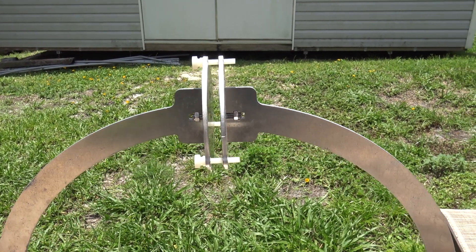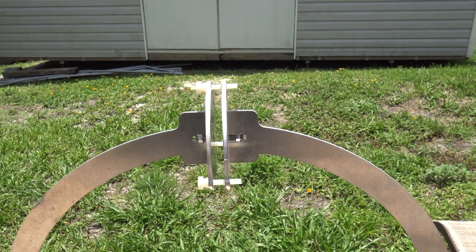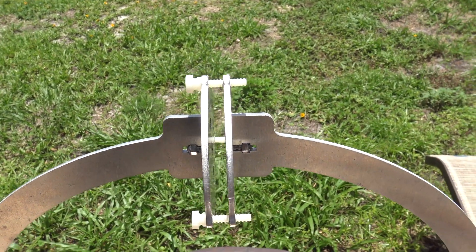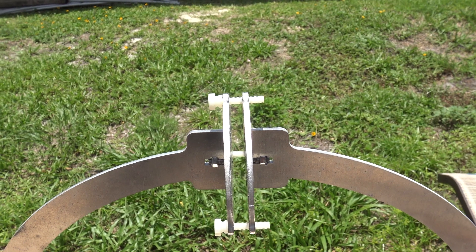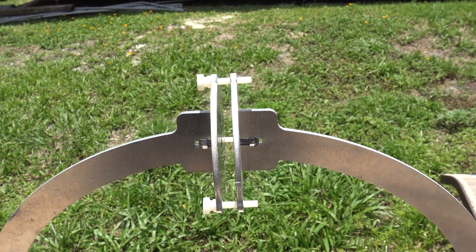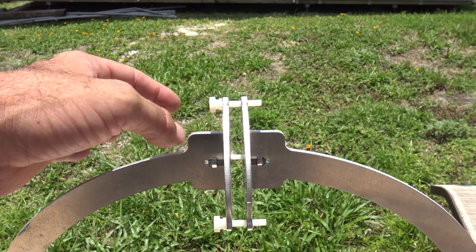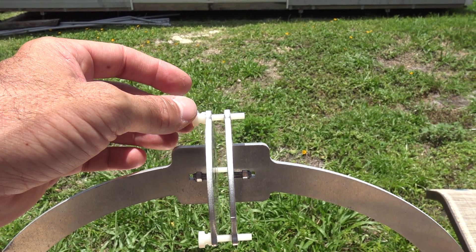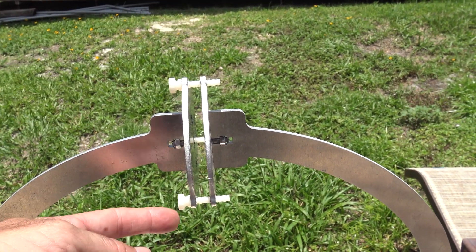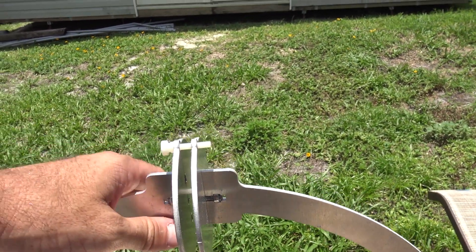I don't think this is recommended for mobile use because if it moves just the slightest bit, forget it. The way a magnetic loop works, the good thing is you focus all your energy on transmit and all your receive on that frequency where you have it tuned, which gives you a lot more gain than a broadband antenna. I was using this with 10 watts and making contacts all over the United States. Those two discs are not perfectly even between each screw and that's okay — you need an analyzer for this because you may be way off and you'll be screwing those things all day.